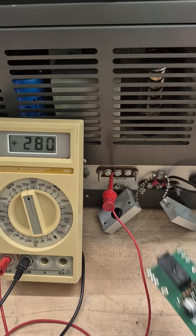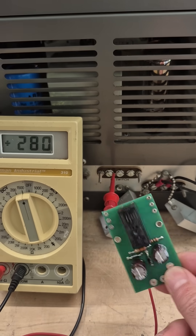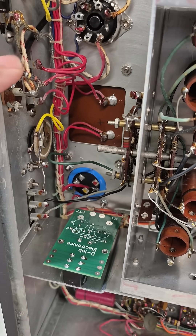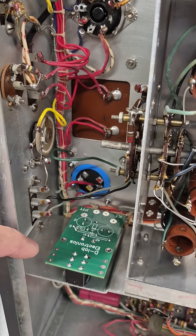D-Lab has a solution. It's called the K1S switching module. This will go inside of the receiver — there's a module in place. I simply adhere it to the chassis. Next, I'll be taking off these red wires and swinging them down to one set of contacts.